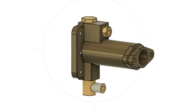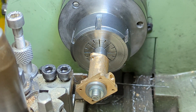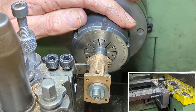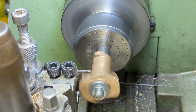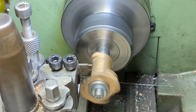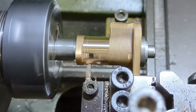I was rather hoping that I wouldn't have to turn the outer body of the pump, but the dimensions of the outlet port means that I will need to clear some space for the hex head on the outlet union. So it's back onto the mandrel in the lathe. First I set the x-axis digital readout at 0 for this end of the body, with the tool almost touching the outlet face, and then for the other end, on this side of the flange, I set my carriage stop. I'm using a parting off blade which is not ideal, but with very shallow cuts to a maximum of 0.1mm deep, the loading on the side faces is manageable. Taking multiple cuts, starting at 0 on my x-axis and moving up to the carriage stop, I bring the diameter down to a point where I can fit the union into the port. I'm not actually looking for a specific diameter for the pump's body here.